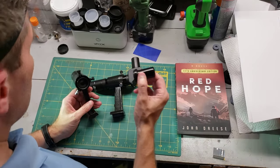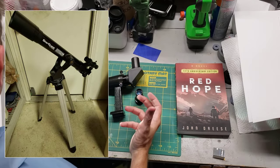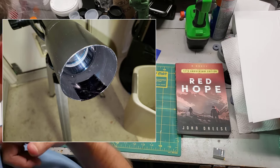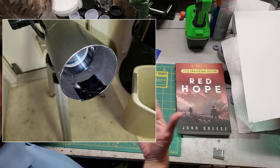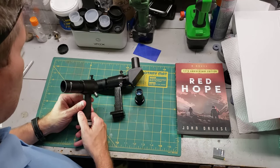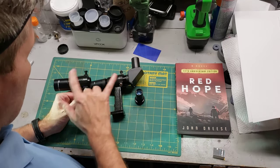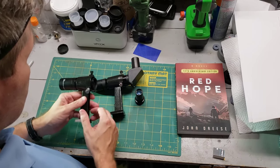This reminds me of a $40 beat-up used refractor that I bought two years ago. It had really terrible optics — it was impossible to focus. One day I noticed it had dust between the two lenses at the front of that telescope, and that's supposed to be a sealed system. I took it apart and ultimately found out that the previous owner had put the lenses back wrong. I was able to fix it and the telescope worked great after that. I think that may have happened here — I suspect the previous owner may have taken the front and back ends off of both of these and put them on the wrong tube. It's easy enough to check.